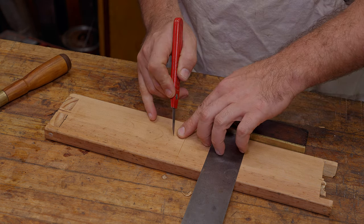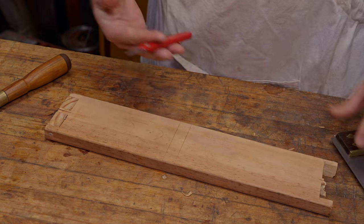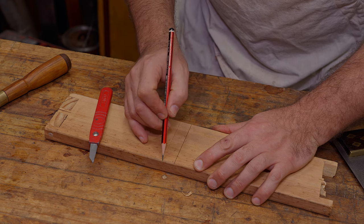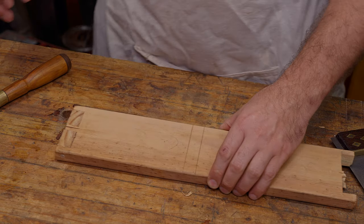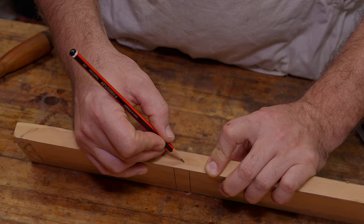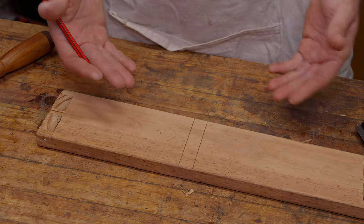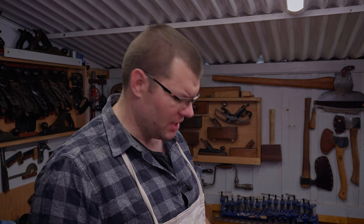I've got a little mark just here. Light pass, medium pass, heavy pass — standard. Now I'll pencil that in so you guys can see it. You also want to determine your depth. Quite often that is about a third of the thickness of the board — you can kind of eyeball it and go, alright, that's where it is. On a 19mm board I tend to do about 5 to 6mm, but generally a third is the rule.